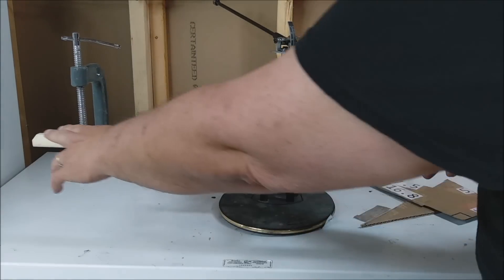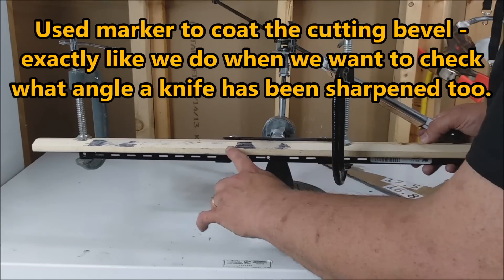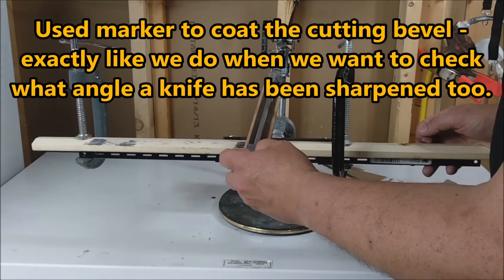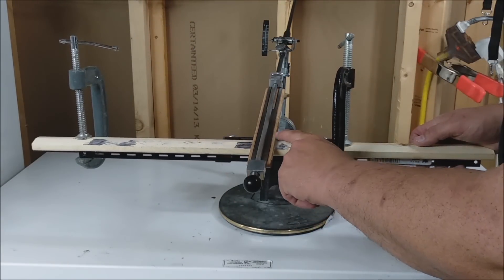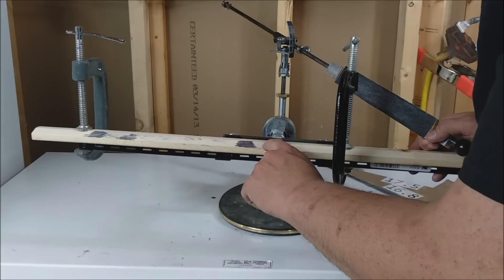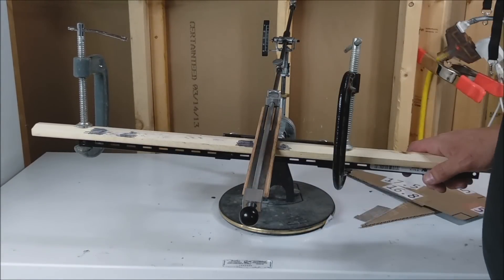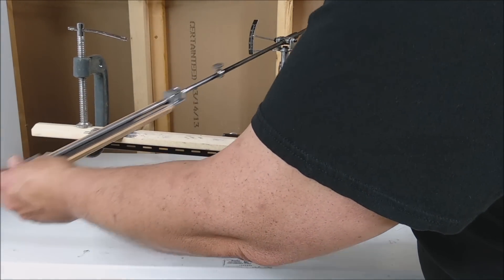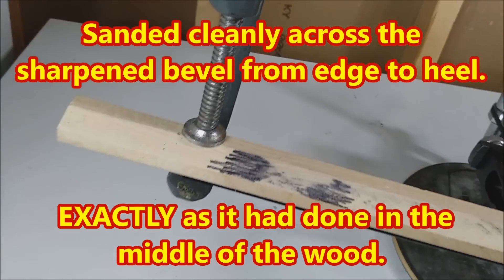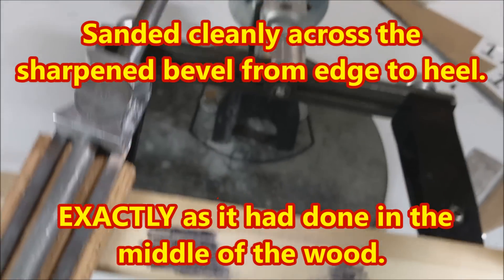What I did was I cut this off and made a 20-degree angle there to start with, just like the bevel on a knife, just to save time. I took a marker and put it across the cutting edge over here and over there, just so I could prove what I'm doing. I found the angle that matches this closely and started sanding — sanding all the way across — and the angle matches perfectly.